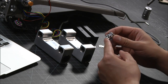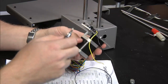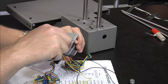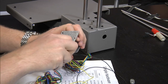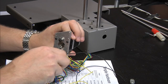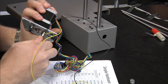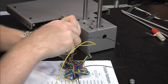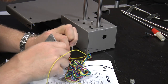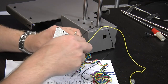I think your piece rode up over here. Maybe it's supposed to. So what happened was you caught your plastic piece on the lip here, and it rode up too high. It caught on that ring around the edge of the motor. Where are those washers supposed to be used? I think they go in the next step. I'm skeptical because I'm looking at the next three steps and nowhere do I see washers. I'm pretty sure that for this step we needed to use the washers. Where, though? There's literally no indication. Oh, wait. Is it under the bearings? Yeah, it's under the bearings.